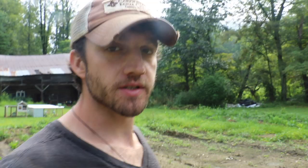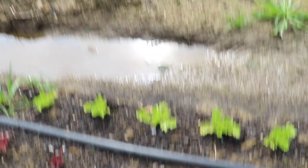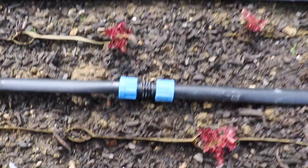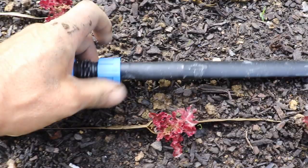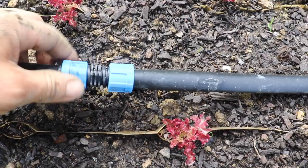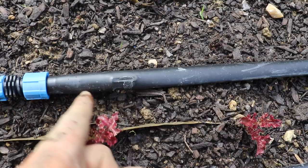A question I'm sure will come up is what happens if your lines break. Yes, lines do break — animals chew them, they get cut with the greens harvester, things happen. You don't have to replace the whole line. All you need are these little repair couplings, available on Amazon or any irrigation supplier. If it's cut, you cut on either side of the damage and basically just put the coupling in between to rejoin it.